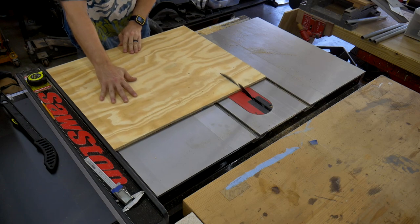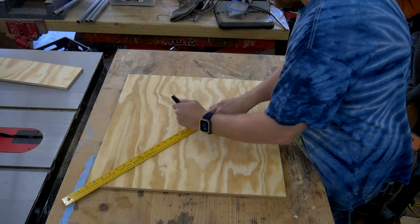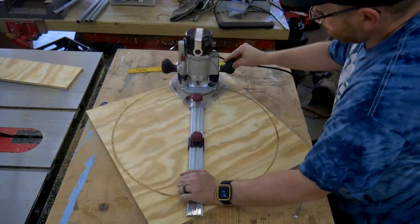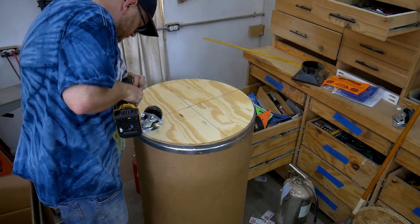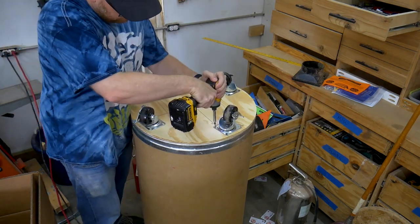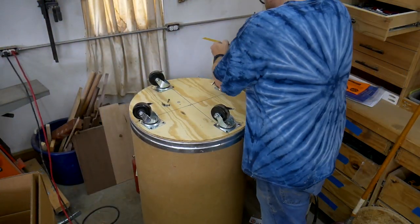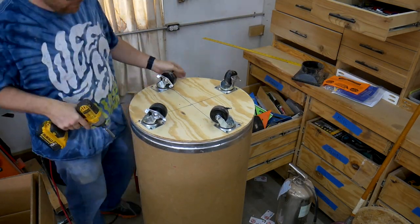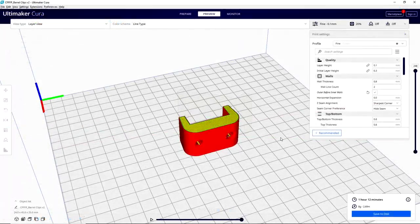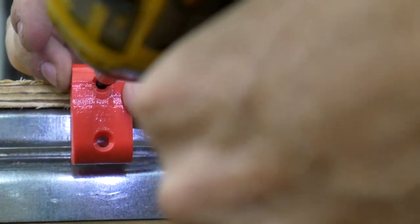I prepare a scrap of plywood by squaring it off at the table saw. I then mark center and use my circle cutting jig and router to cut out a circle the exact diameter of the bottom of the drum. I attach four casters to the plywood circle, essentially turning it into a drum dolly. To secure the dolly to the drum, I designed this solution in Fusion 360, since driving screws into the cardboard bottom would just pull through. I sent the design to my 3D printer and turned out a handful of barrel clips. Using the metal rim of the drum, I was able to securely fasten the dolly to the drum with these clips.